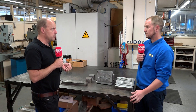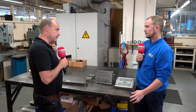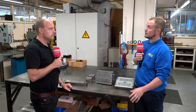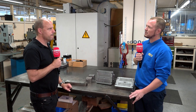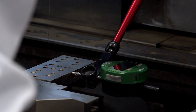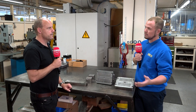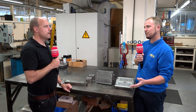So does it get to a point where you can't machine these, and if so, then it goes on to the EDM side, the spark side? There are some limitations to what you can do with milling — you're limited to the tool that you can use, and that is the greatest limitation to speeds, feeds, and efficiencies. Classic example, we go down to about a 0.2 cutter, but rarely. 0.3 and 0.5 are our bread and butter. This is obviously going to leave radiuses in corners. Some of our parts need to be sharp edges, so that's when we will produce electrodes, again on these machines, so we can spark out pockets, cavities, and create sharp corners.